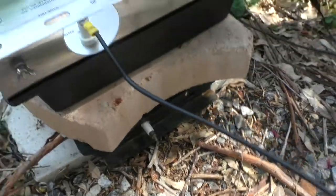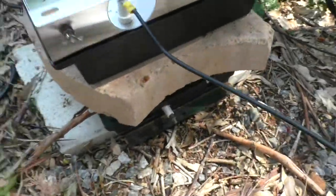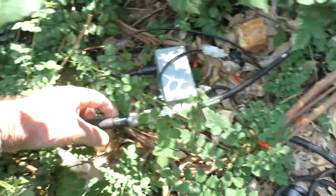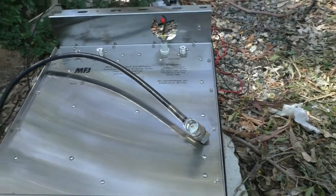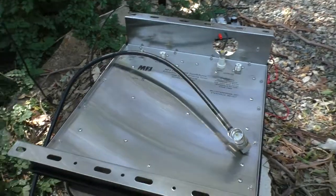I've taken the wire antenna off of the SGC230 down there and put it onto the MFJ998. I've taken the two ground connections off of the SGC230 stud and put them on the 998. I've connected that through to the 12 volts coming down the coax from the bias-T at the top of the house, and pressed the PTT on the radio and it didn't tune.